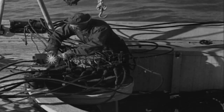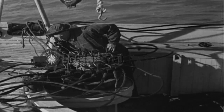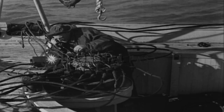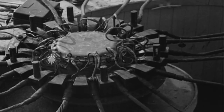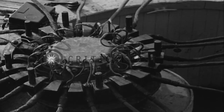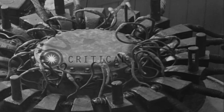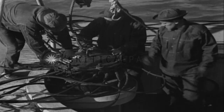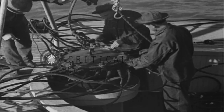When the last mine has been planted, the casemate is notified that the distribution box is about to be planted. After that, all messages to shore must be sent by radio. This shows the 20 completed watertight joints inside the distribution box. The distribution box cover is lowered in place and securely locked by driving split keys through slots in the studs of the box.